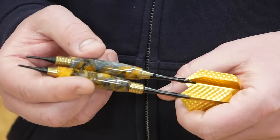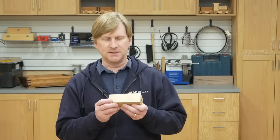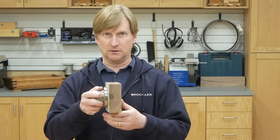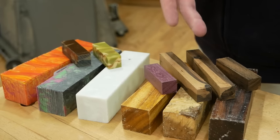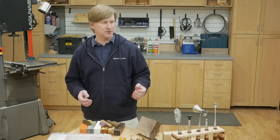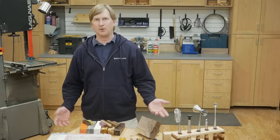Another project that also uses cylinders are darts and seam rippers, so there's a lot of options in this category. All of these projects employ a technique known as spindle turning, which means the grain of the wood blank runs parallel with the lathe — the workpiece is turning this way — as opposed to face plate or bowl turning, where the blank is mounted with the grain running perpendicular to the lathe. Which brings me to the topic of the turning blanks. We offer a huge variety of wood species in terms of colors and grains, and then there are the acrylics, which come in a rainbow of colors, so you can mix and match the turning kit with the blank to create just about any project you can imagine.